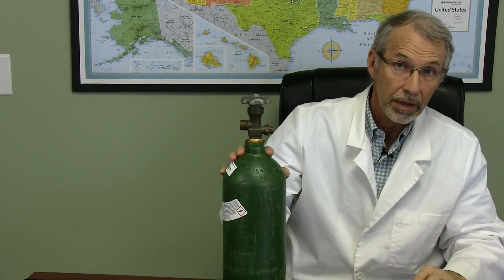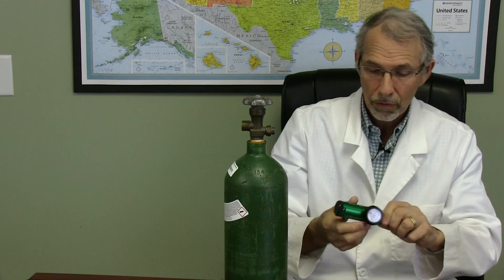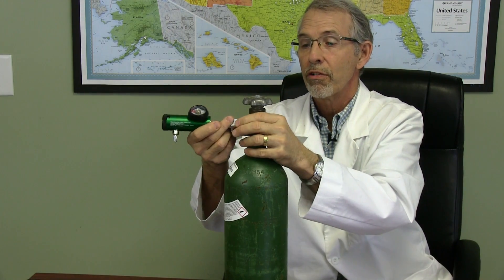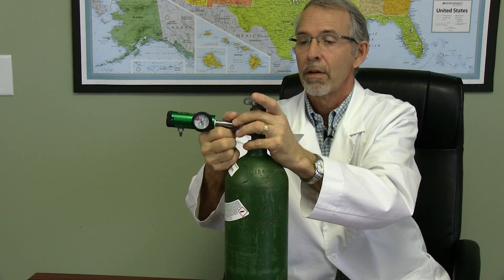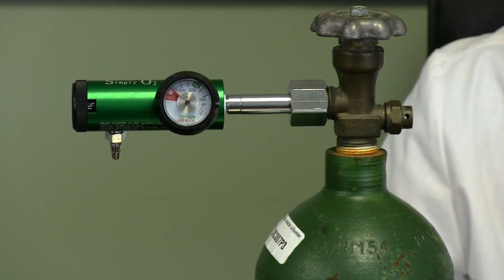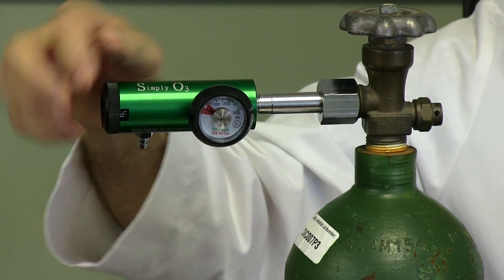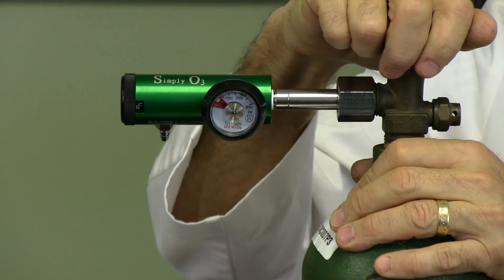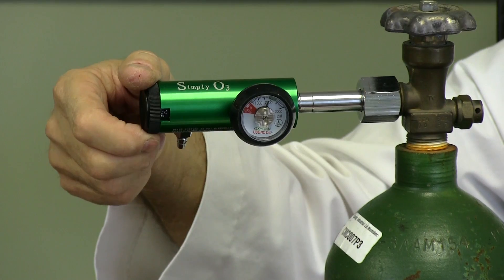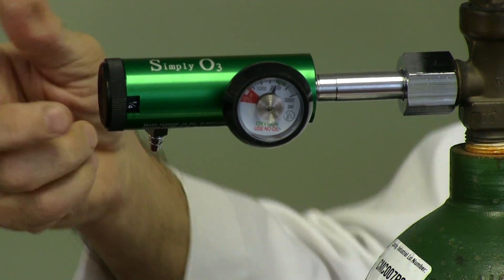If you're going to use this kind of tank — an industrial oxygen tank — it has 100% oxygen in it. You need what is considered the 540 regulator. It has a big nut on the end that attaches to the tank. We'll get that started and spun on. On this type, you need a wrench and need to tighten it down well. Now you can see this regulator — I'm going to turn the gas on and the regulator is going to turn up. To control the speed of the gas, I turn this dial: 1/32, 1/16, 1/8, 1/4, and the gas is coming out.